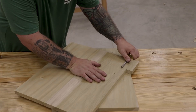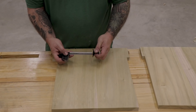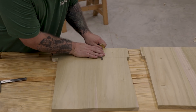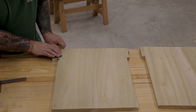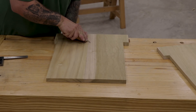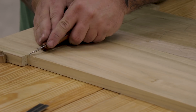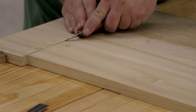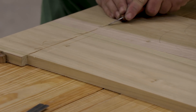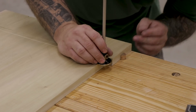At the end of the first part of this build, I was finishing up the end boards and putting the notches in them to accept the sides. Now I'm going to mark out where the dados are going to go to hold the bottom in. Once I've established the location of the dados with the marking gauge, I'll come back with my knife and deepen the lines. I set the gauge to a quarter inch to mark how deep I'm going to make the groove.